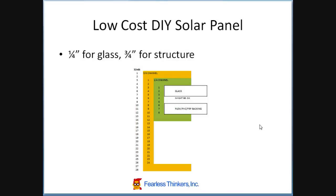The next approach would be kind of similar, but instead I'd use a 3/4-inch piece of channel to encompass the upper quarter-inch channel. That would obviously give a pretty stiff upper area for holding the array structure together, and it would give me another dimension to be able to put another bead of silicone to seal up the glass-to-channel interface. So that's one advantage of this approach.